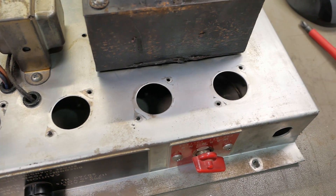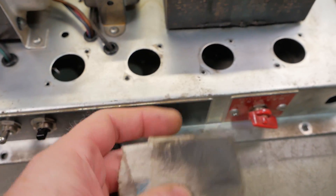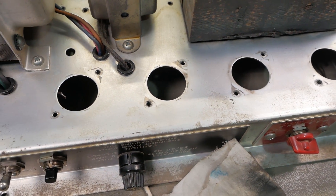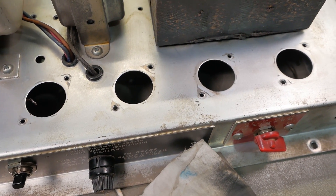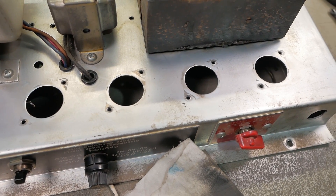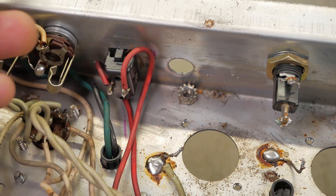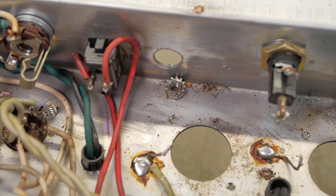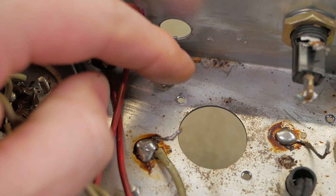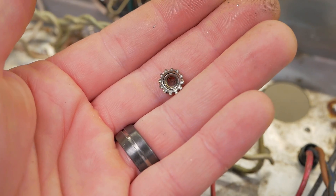With the sockets removed, that gives us a fighting chance of cleaning all the tobacco residue off that area as well. There you go, that looks a bit better - that was nothing more than shellite on a rag. Shellite is known in the US as naphtha - it's just a light petroleum distillate, used for Zippo lighters and the like, but it's got lots of applications in guitar and amplifier work. I'm glad I took that switch out - I found a random keps nut stuck in the shmoo underneath. You can see the footprint it left on the chassis.